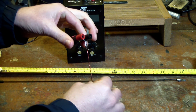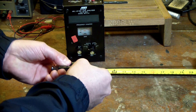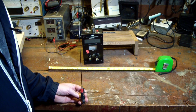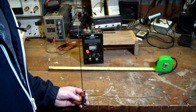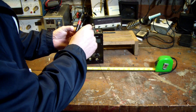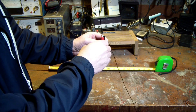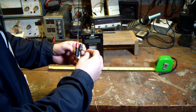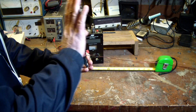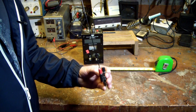And that's fairly tight — it's not going anywhere. Then the banana plug, we just plug into the red side, which is the center conductor. We now have a ground plane vertical that you could snap on the top of your HT. Or if you wanted to, you could take this and bend it downward like so, and you've kind of got a dipole or vertical dipole. This would just clear the back of the HT and give you a vertical dipole. With the ground plane vertical configuration, it's going to draw the signal off a little bit in the direction of that ground plane, so you kind of get a little directionality. You could aim this towards your repeater.